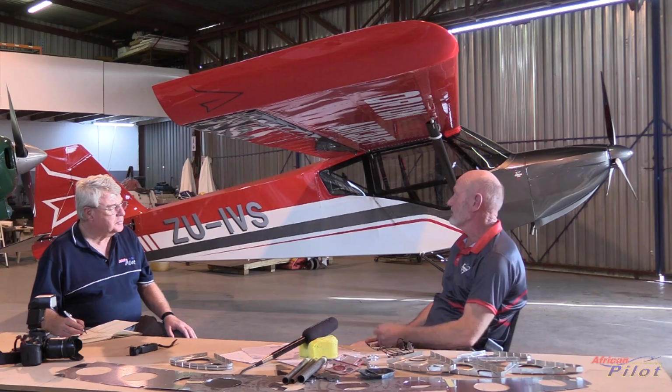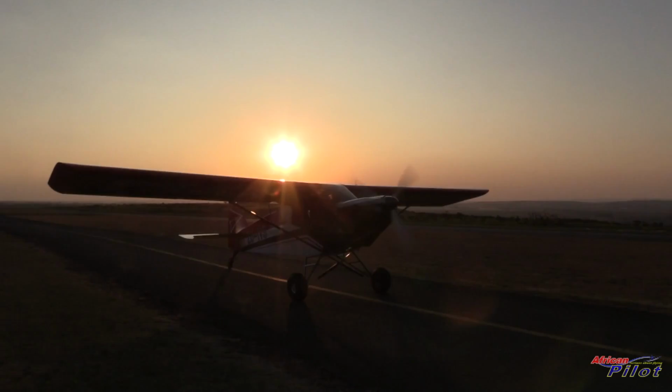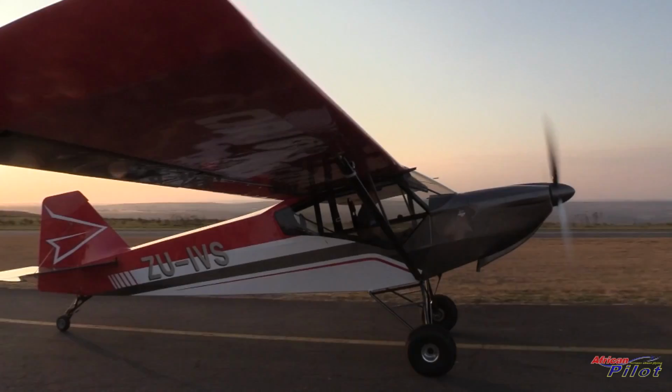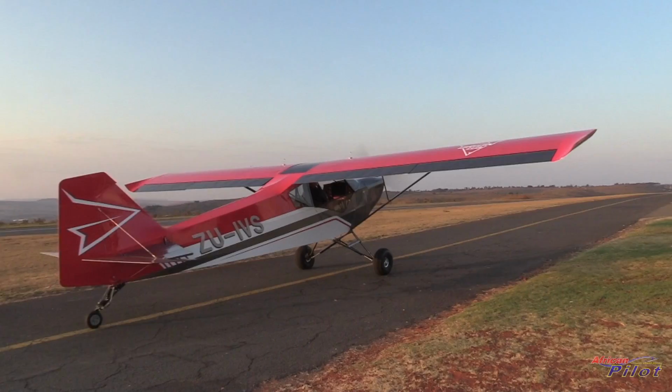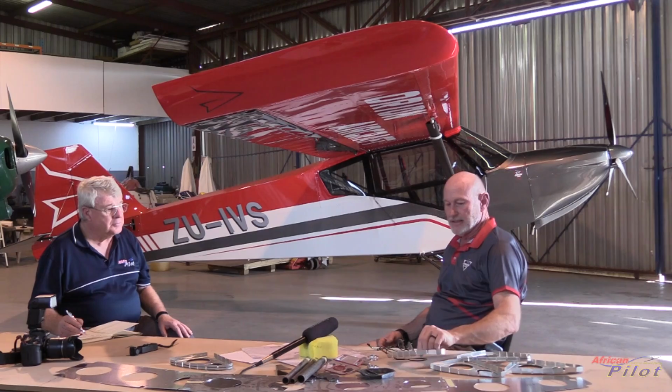And thereafter I ran out of money, which is, in this game, quite easy to do, and I shelved the whole project. And then back in 2019, I decided now's the time to get going. We have a little bit of money. The idea was to build a very nice cub-like aeroplane, a little bit lighter, and doing it with not just modern materials, but to do it in the modern way, which was CNC cutting all the parts, CNC routering the likes of ribs, which we've made, and to cover it with Dacron.